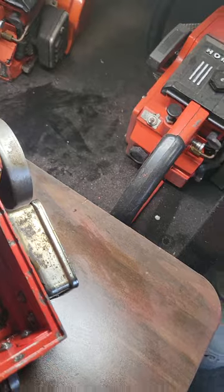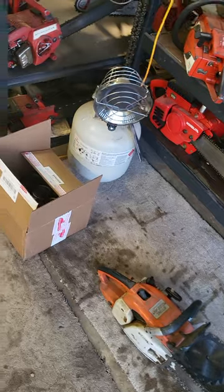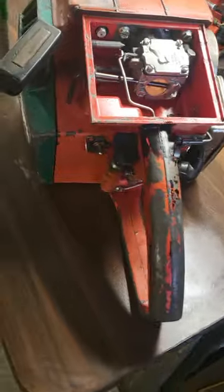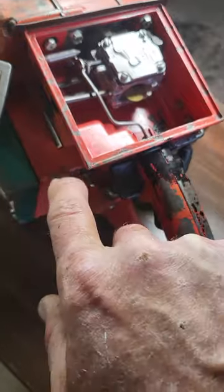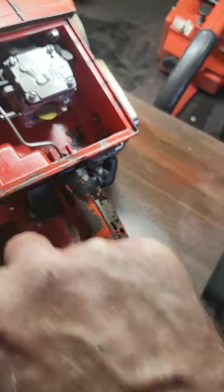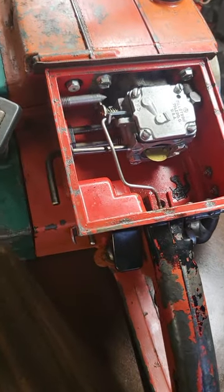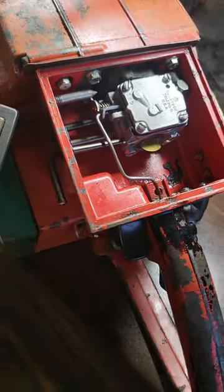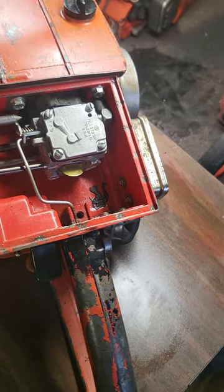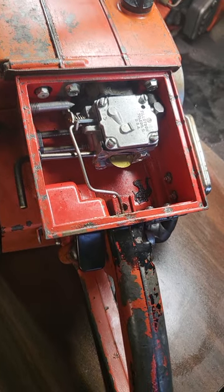Several of the saws, like the 870s, let's see, the 870 and the 903 and the 904 had this weird choke over here on this side with a round lever, just a plain round lever. Some of the other models probably had it too. I don't know. Some of these saws, I think they put together from a parts bin, put different carbs in them. Some of them had Walbro, some of them had Tillotsons on different models, so you never know. I guess they run what you brung.